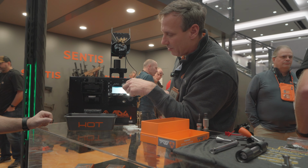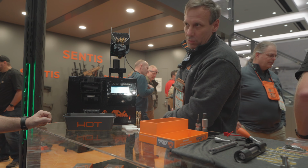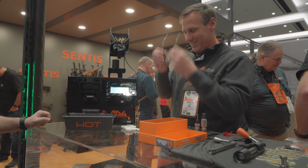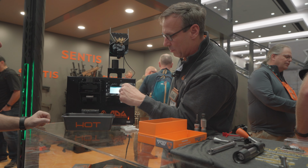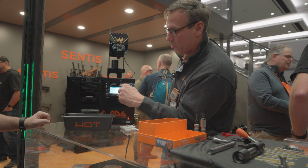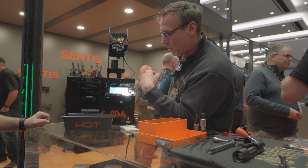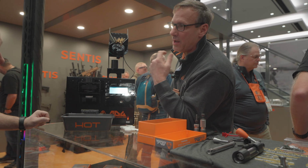And then the nice thing is, you can see right here, which hopefully you can see. I can't see when I'm this close. But we had a setting of 350 degrees C on the second to bottom sensor, and you can also see where the temperatures were. So we were 323 on the bottom sensor, 371, 357, 341 at the top sensor. Right, and it took 1.099 seconds.